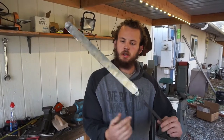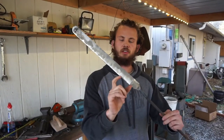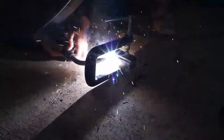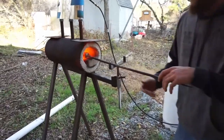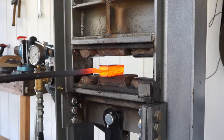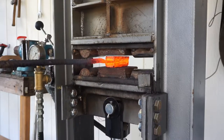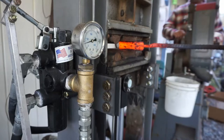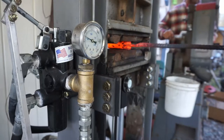Here she is, ground up. We marked it in three-inch sections and stacked these five times after we get them cut in the bandsaw. We just had some successful forge welding — we took the billet up to about 55 layers of that stacked 15N20 and 1084.